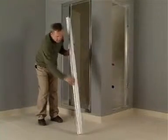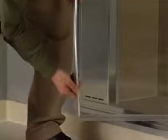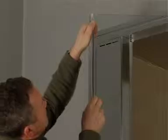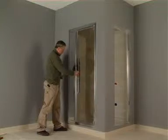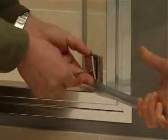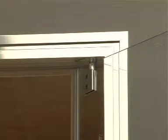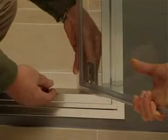The packing also contains a seal, which, when installed on the edge of the door's glass panel, ensures it is hermetically sealed. If the door does not adhere perfectly, adjustments are possible by turning the adjusting ring nut low down, as we can see the operators doing.